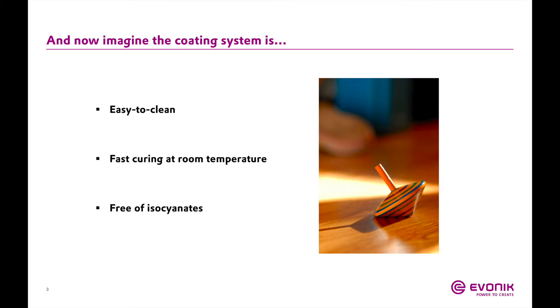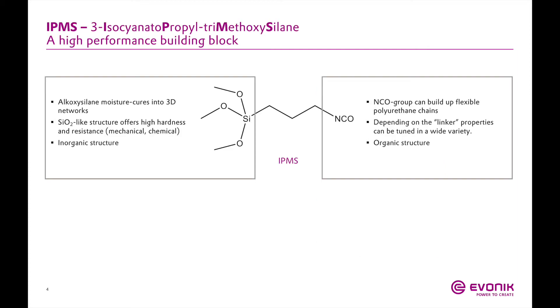In addition to the very good scratch resistance, these systems also have other advantages over traditional polyurethanes. They're easy to clean, due to the degree of crosslinking in the polymer system when it's in a thin film. These products cure incredibly quickly — much faster reacting than a traditional polyurethane — and they react at room temperature. Some products can be touch dry within one hour. And most importantly, unlike polyurethanes, they're free of isocyanates. There is no isocyanate monomer or polymer in the system, so the applicator is not exposed to the hazards typically associated with isocyanates and polyurethane systems.